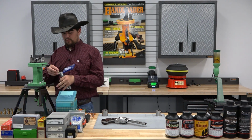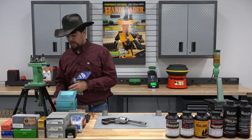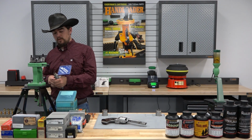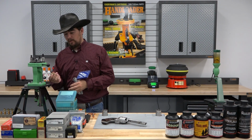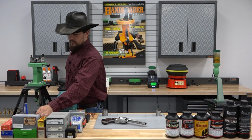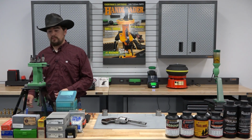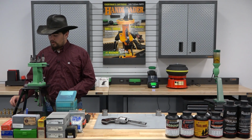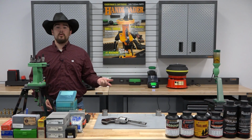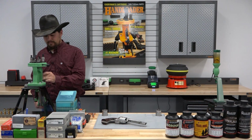That's something you should watch for in this 454. Oftentimes the primer pockets will loosen up before the case splits. And of course, we're using Starline brass, exceptional high quality stuff. So I'm not going to show you dumping powder. That's a pretty straightforward process, and I feel it would be redundant. All our powder was dispensed on either a Matchmaster Redding 10X powder measure or a Redding BR30 powder measure, depending on charge weight and what we were doing.